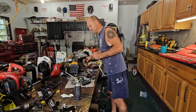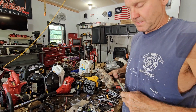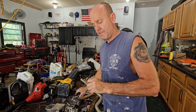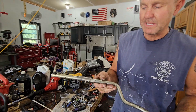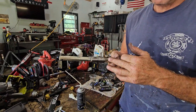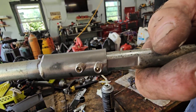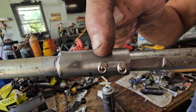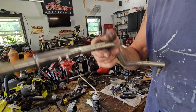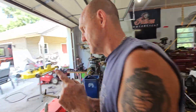Just make sure you make alignment marks for all of these, or else you're not going to be able to put this thing on and your knuckles won't line up. Here's my link — it's going to be dead-on perfect. Put a little Loctite on here; it's going to set on the flat portion of your steering link. Set your set screws in with Loctite on them, and then you should have a perfect toe-in adjustment.